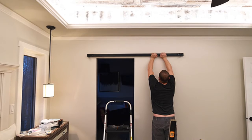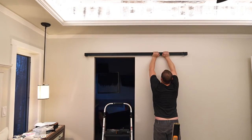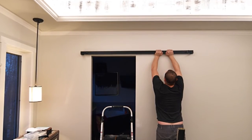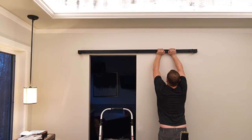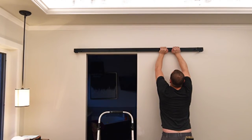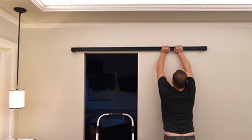The hardest part of a barn door installation is to make sure the track on the top of the door is securely fastened into your wall. We were lucky because we have wooden headers behind and on top of all of our doors, so we just bolted the track right into the wooden header. If you're not so lucky, you'll just have to make sure that the holes in your track line up directly with studs in your wall, or just add a piece of trim across the whole entire top of your door and then secure the track onto that.